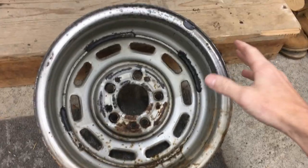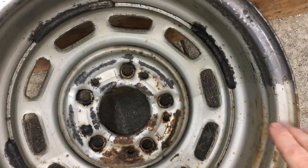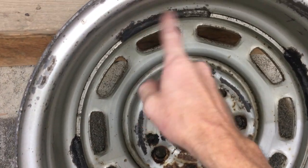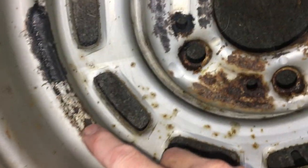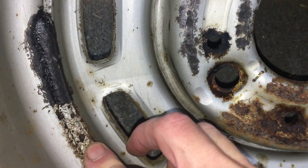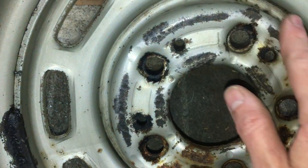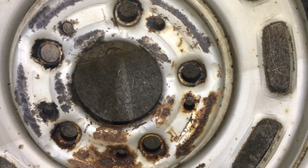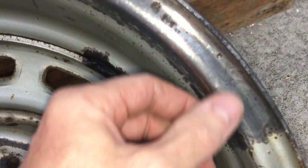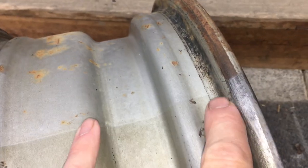Here's a look at the wheel after I brushed it up with a wire brush and dried it off. The top half is the half that received the electrolysis treatment and you can see all the rust that was around here is now black. Here's a good before and after — this rust is actually underneath the paint and when I was brushing it the paint was just coming right off. So it did work pretty well. Same with all this around in here — now it's pretty pitted. This is an Ohio wheel so I'm sure it's seen a lot of salt over the years. And up here the paint was completely stripped — I don't know why that happened. Around the barrel of the wheel it's completely stripped all the way across. Here's the solid line from the other side — look at that before and after, that's a great before and after right there.